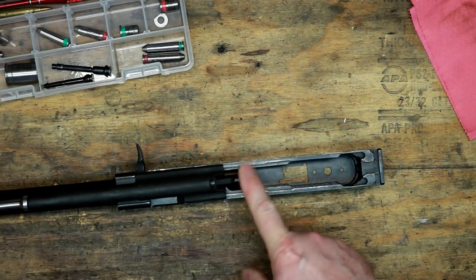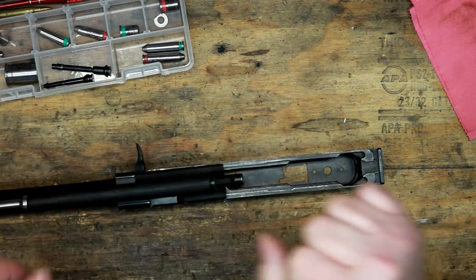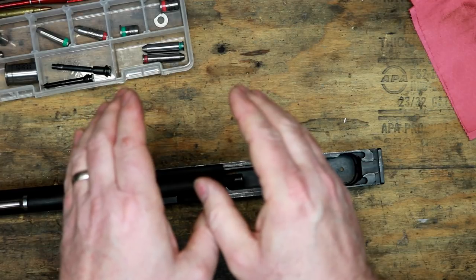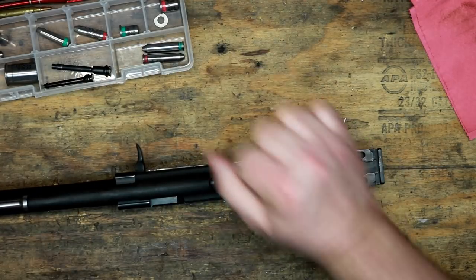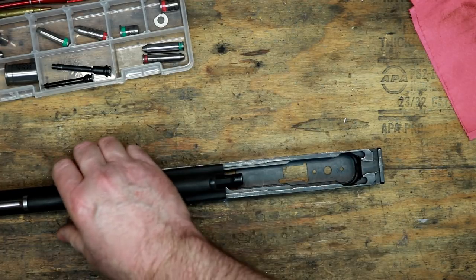A lot of people don't realize they set false headspace, even with the carrier. You think the bolt is rotating fully because the carrier went all the way forward, but your bolt stopped on a section, and instead of rotating, it's tipping over sideways, and then you can get it into battery. The carrier will go all the way home. And that's a false headspace.